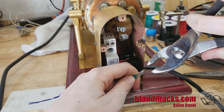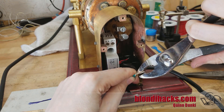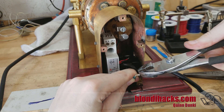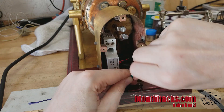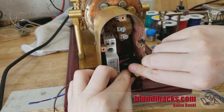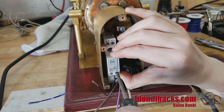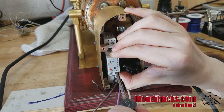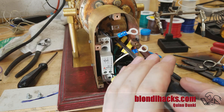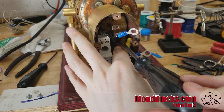All of the ground connections we've been making are twisted together and secured with a wire nut, and I do the same for the bundles of live and neutral wires. Wire nuts are a good application for this type of thing, and then that wire nut just gets tucked into the back. I'm working back to front because the space is tight inside this box. There's a series of jumpers needed to connect to the contactor and heating element. For the connections on the heater itself I'm using ring terminals — that's the ground connection for the body of the heating element, and I've done the same for the neutral and hot wires.